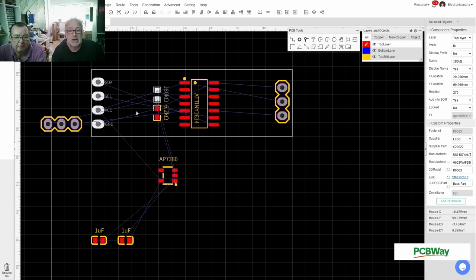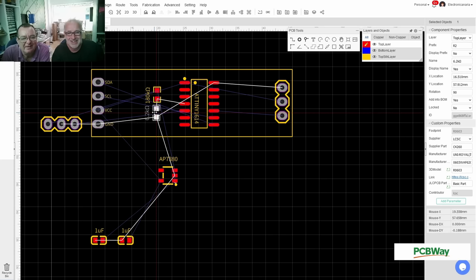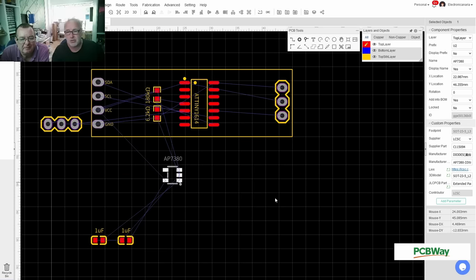I'm skipping, by the way, this is horrible. Oh my god, what a mess. You see these both connect over here, so I'll put them somewhere together. And maybe I can line them up so my inner ADHD won't scream at me so much. I'm going to put the little voltage regulator on the bottom layer, not on the top, so I can have larger pads for heat sinking, copper pours everywhere.